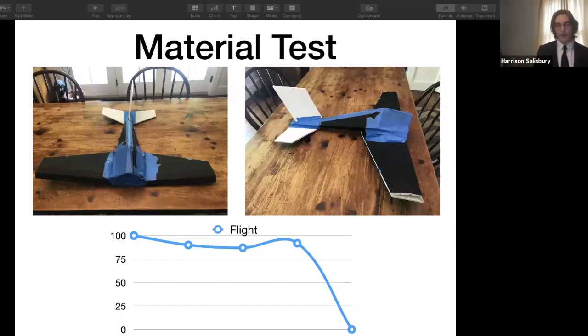This is a good and also a bad flight path. Good in the form that it shows that the plane did create lift with the wing surfaces. Bad in that it was too tail heavy and it stalled at the fourth point and then fell and nosedived. That is a bad flight path. It's better to have a slightly nose heavy plane. It's easier to fly.